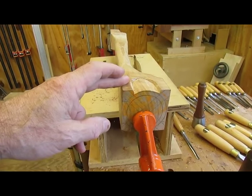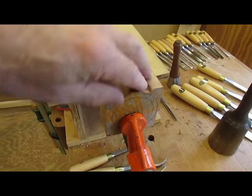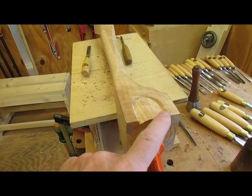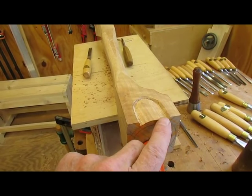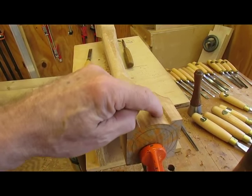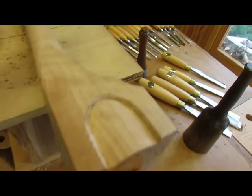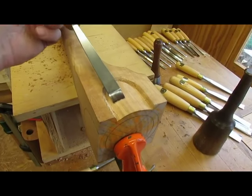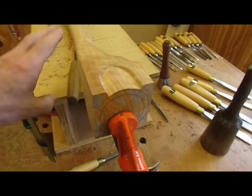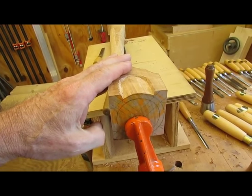I've just started out by making a cylinder and we're going to carve all four sides out to this particular line. I started by setting in here with the V chisel and now I'm using a half-inch flat chisel to start to pare it down. Carving the cherry is a lot harder than carving the mahogany, so that's kind of where we're at.